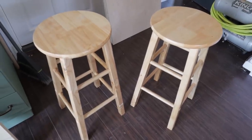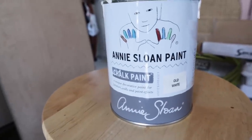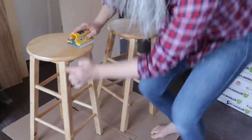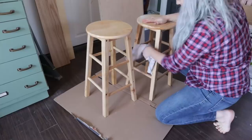The first DIY project I'm tackling is my side tables. I didn't want anything big and bulky because of those slanted ceilings — I'm already fighting a lot of space. Both Jeff and I don't really need a lot of side table space. So I decided to go a little unconventional and thrifted two wooden stools. I didn't want to leave them blonde, so I pulled out my chalk paint stash and used the Annie Sloan color Old White. This step really wasn't necessary, but I did decide to sand each stool first — you can pretty well paint over anything with chalk paint without prepping it, but giving your piece a light sand is always good practice. It just ensures any paint you add will stick that much better.